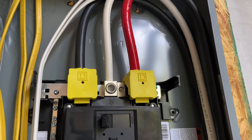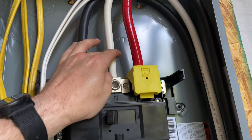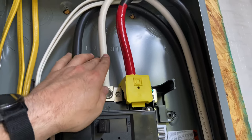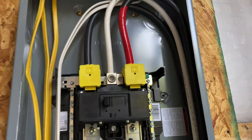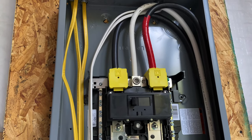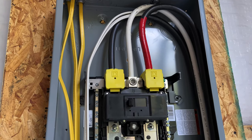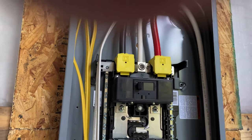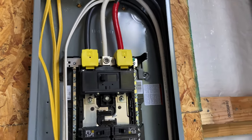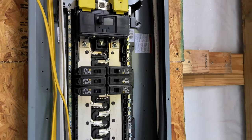This particular cable came with a 4/0 aluminum for 200-amp service and a 2/0 step-down neutral, which is perfectly fine from what I gather. I'm not an expert on the code — this is my first rodeo and I'm learning along with you. But they sell it like this and it's very common; the math behind it makes sense as to why you can downsize the neutral. It also came with a 4-gauge ground wire, which I will not be using.